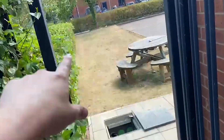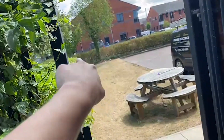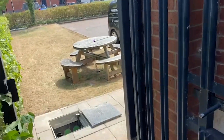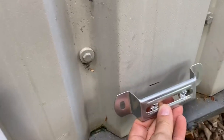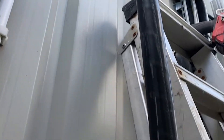We're back down today getting the cable tray in. We've got cables all the way through to all the points, data cables between every charger, four cables going one way (6mm 5-core) and two 6mm 5-core going to the two chargers at the front. I've cleared the cable out so it should tuck in nicely and lay onto the cable tray. I've got a little bracket, got a level, mapped down the fixing points — one every 600mm, which should be plenty.